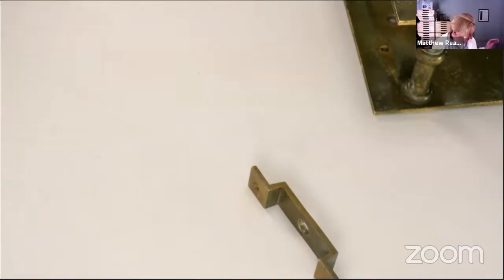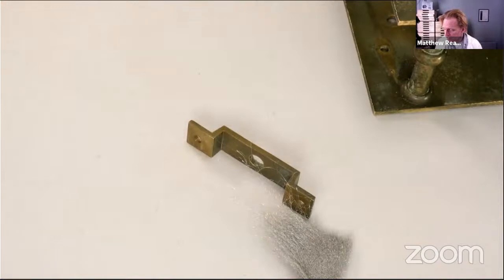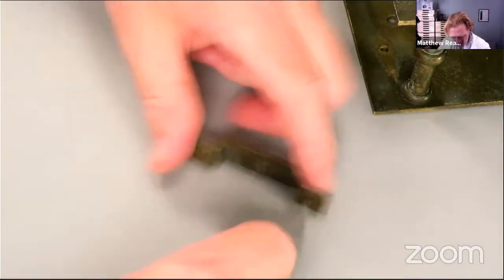And I'm going to do that with a bit of 4/0 steel wool. I use this Liberon steel wool. As we always say every week, make sure that you store and dispose of this responsibly because it can burn like crazy. A bit of a fire hazard. So either put it in water, then get rid of it, if you don't want the place burning down. So I'm going to clean that with steel wool, a bit of pegwood. We'll use our pointy stick.